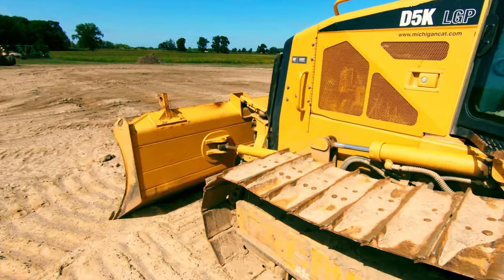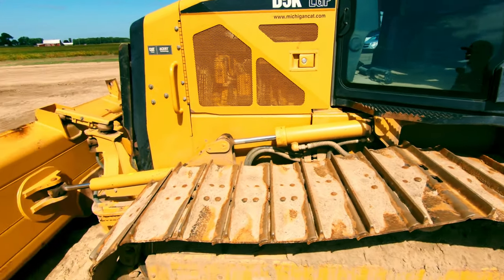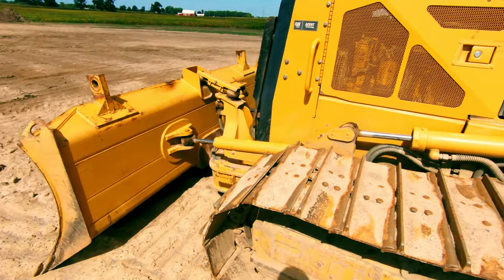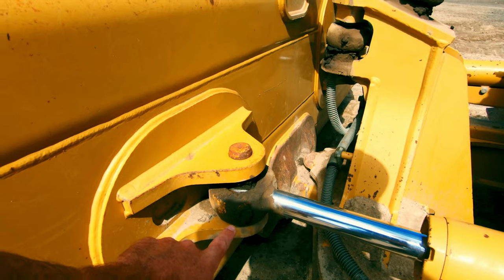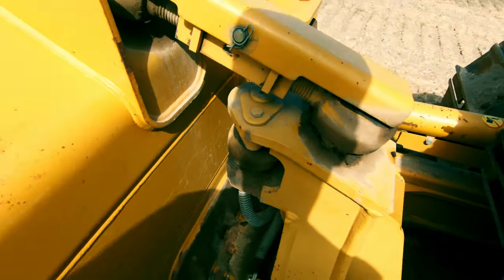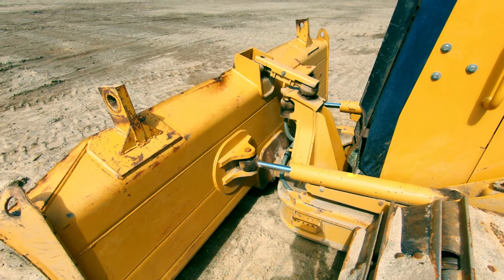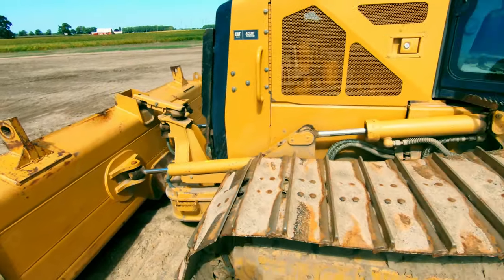The final thing you're going to do before running the machine is grease it. Grease needs to go wherever there is movement, so all of this stuff here needs grease. You do that by using these little zerk fittings. Your grease gun pops right on that nipple and you give it about five pumps, grease that joint, then move on to your next one. The whole machine needs to be greased before running it for the day.